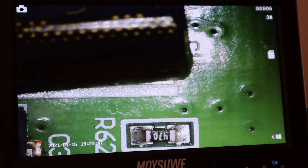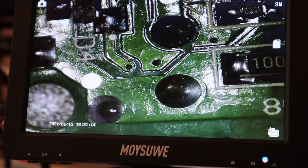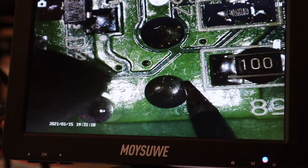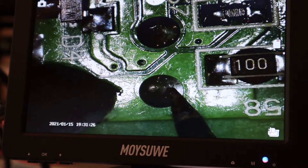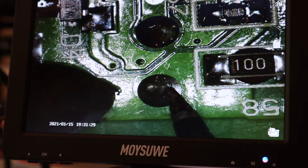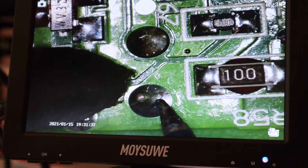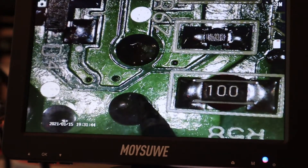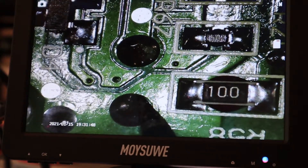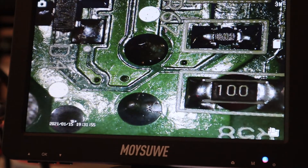Let's get set up to remove these capacitors. I got the board flipped over — I'm going to start with that solder joint right there. It's the first time I've soldered on camera, so don't judge. I have a Weller soldering station here, but anything with a small enough tip should work just fine. I'll leave a link in the description for some less expensive soldering irons. These always take longer when you're waiting. Might be time for a new tip — let me dial in a bit more heat.